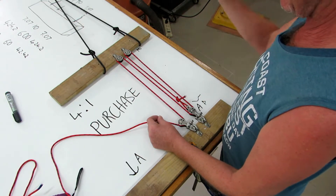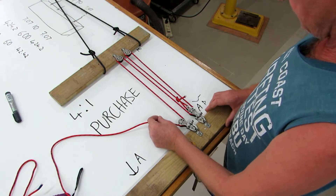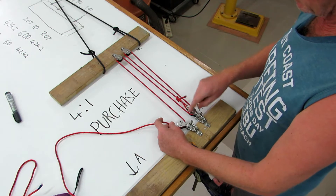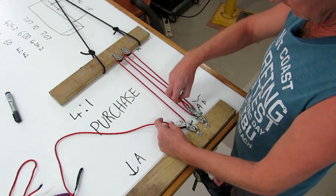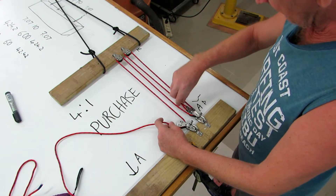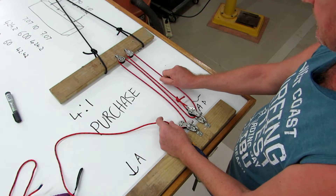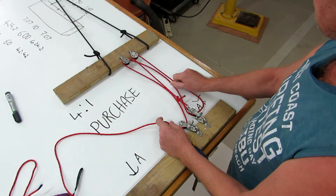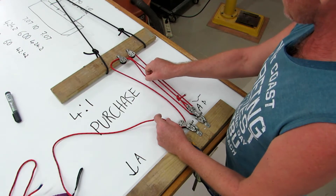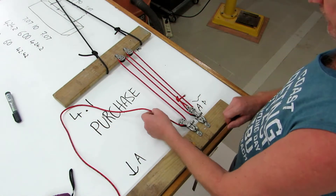I'm also teaching my daughter, so I might make it six to one later on. How does it work? We have the anchor pulley — the anchor block — and this is tied to the bottom block of the boat. This piece is called a becket. Because we have a pulley here, it's like an upside-down crane. When I pull this one, I'm pulling two to one. Then pulling here it's three to one, and pulling here it's four to one.